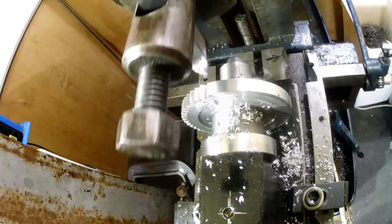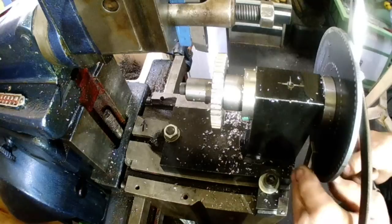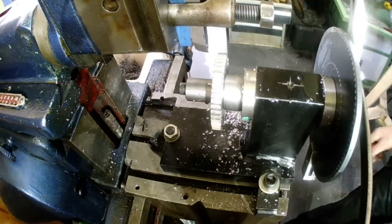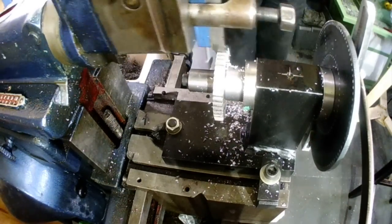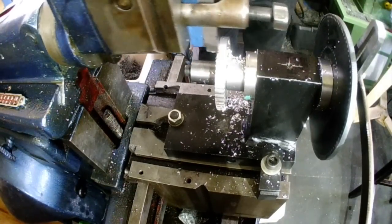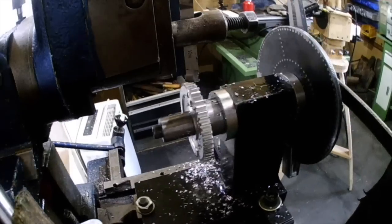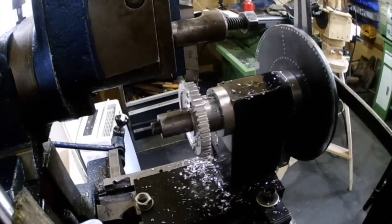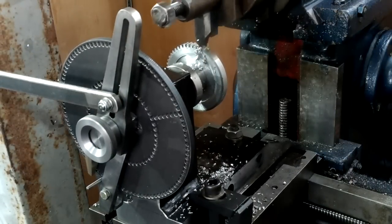My way of dealing with the peculiarities of gear making was to make a spreadsheet that calculated and manipulated the information at hand to formulate the important calculations. At the moment, if I input the outside dimension, or the PCD, the pressure angle, and the number of teeth, the spreadsheet spits out the corrected PCD, the outside dimension. It repeats the number of teeth, the tooth thickness, the depth of tooth, the width of the cutting point on the tool, the mod, the diametral pitch, and the root dimensions. Pretty impressive, eh? Well, I think so.